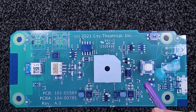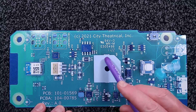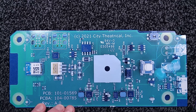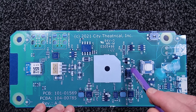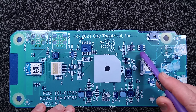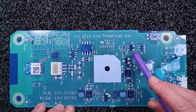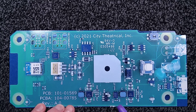Let's explore the circuit board of the DMXCAT. The first and most noticeable component is the sounder — if you lose your DMXCAT you can send a signal to it and it'll make loud beeping noises so you can find it. Here's the USB charge connector, and I'm guessing this is possibly a charge control chip. These components here look like they could be a DW01 battery protection chip — the lithium cell takes up the whole back of the PCB and doesn't appear to have onboard protection, so separate protection with a dual MOSFET on the board would make sense.